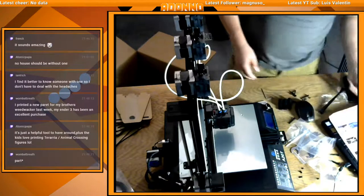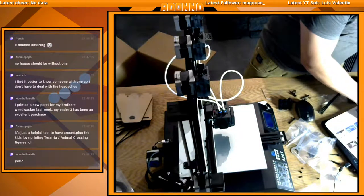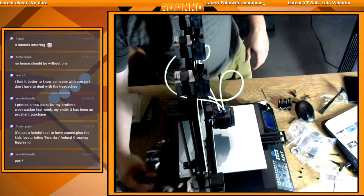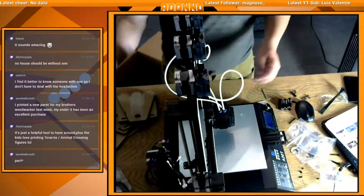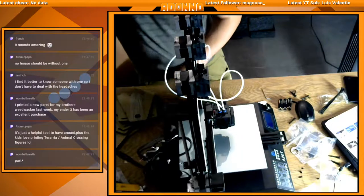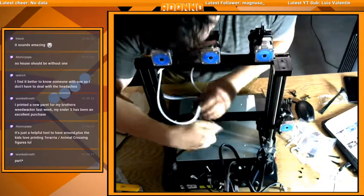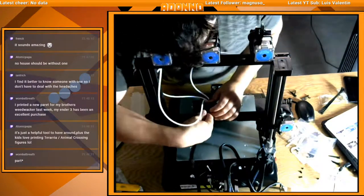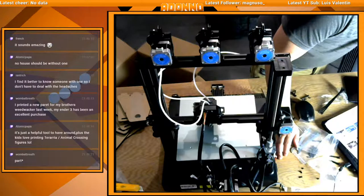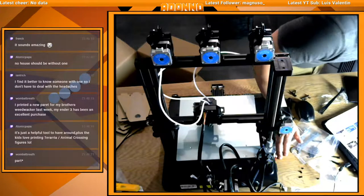Okay, so we mounted this. They tell you now, step one, step two, plug the extruder cables into the socket of the extruder head adapter plate and the buckle must be fastened. So let's take the extruder cables here. So this cable is to go into here. Click, there we go. And the buckle must be fastened. Connect the motor wires E0, E1 and E2. So where is extruder 0? That's the good question.